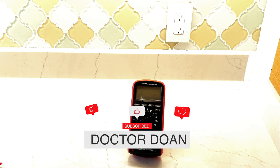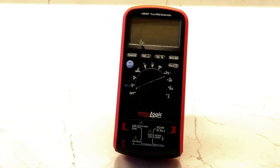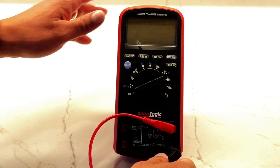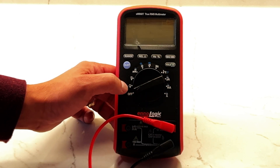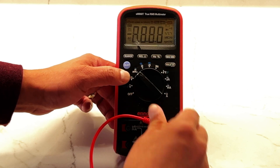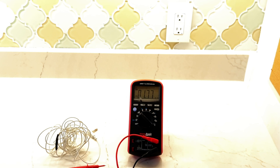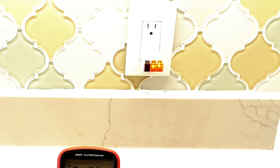To measure my body voltage, I use the InnoLogic auto-ranging voltmeter. I place a link in the description for the voltmeter and the earthing products that I am using. I plug the red positive lead into the slot on the voltmeter for measuring voltage and resistance, and the black negative lead into the common slot for the ground. I turn on the voltmeter and turn the dial to millivolts alternating current or AC, denoted as a tilde squiggly symbol. I use a standard earthing grounding cable for my ground and confirm that my electrical outlet is properly grounded with a standard ground checker. Two orange lights mean that the outlet is grounded.